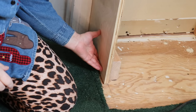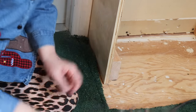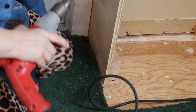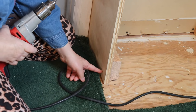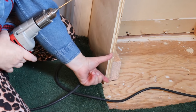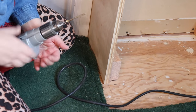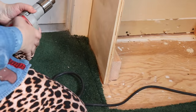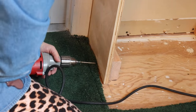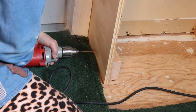So now I'm going to secure it at the bottom. Don't worry about the screw showing on the outside because once I have the new carpeting, there's going to be a trim right here and on the other side too. Same thing at the bottom of the closet. Hence the reason why I'm not too concerned with whether or not the bottom is nicely smoothed out — because it's hidden. Alright, let's go.